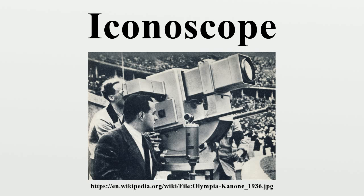As the electron gun is tilted compared to the screen, its image of the screen is not a rectangular shape but a keystone shape. Additionally, the time needed for the electrons to reach the upper portions of the screen was longer than the lower areas, which were closer to the gun. Electronics in the camera adjusted for this effect by slightly changing the scanning rates.